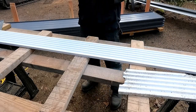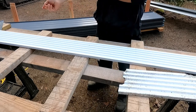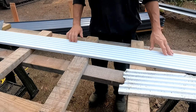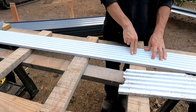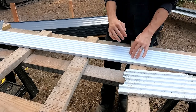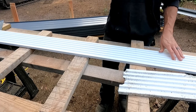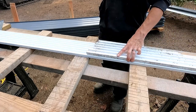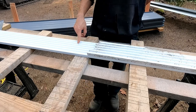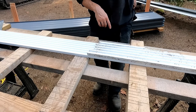The last bit of fascia is the trickiest, because it is a rake piece, and unlike the eave the rake does not have a sub-fascia. There's no board straight behind this that I can run screws in from the inside without through holes. What I did last time was put pocket holes in the purlins — the boards that come out that this screws into — and I lined those holes up so the screw would land on one of the ribs. Problem this time: the new piece has smaller and more closely spaced ribs, and all the pocket holes are already in those boards, so my screws are going to miss and screw into nothing. Screwing into nothing doesn't hold a building together.